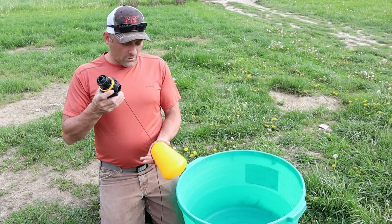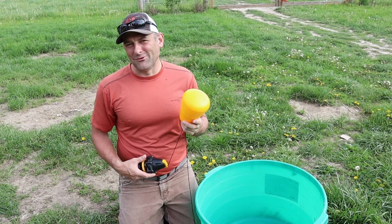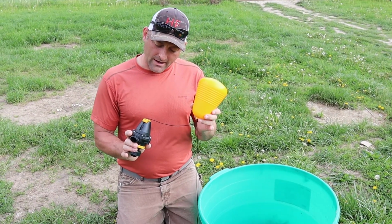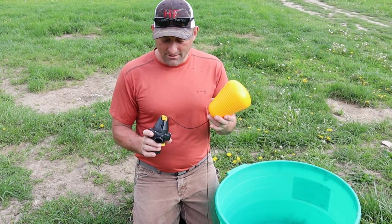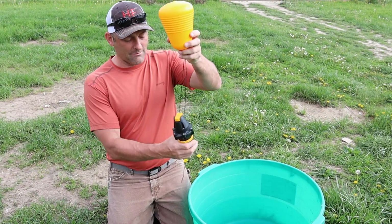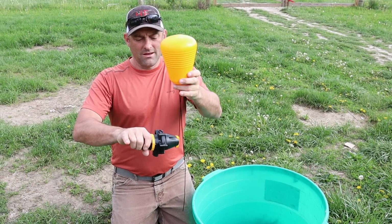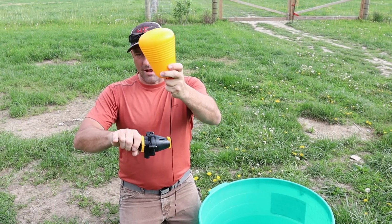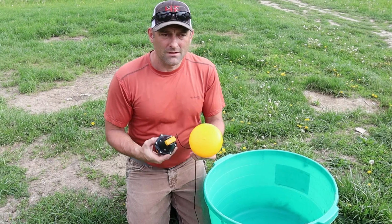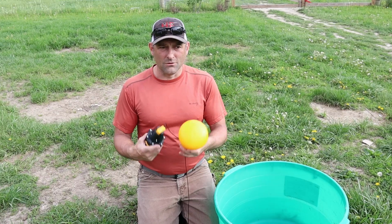Due to our wonderful instruction from one of our really close mentors on YouTube, Judy, he uses the Megaflow float valve, from jobevalves.com or on Amazon. This is nice because you can install it at the bottom of the tank, or on the side of your tank depending on your configuration, and the float just pops it off and turns it on. Literally you just drill a hole into a float bucket and you can install it and put it into operation pretty quick.